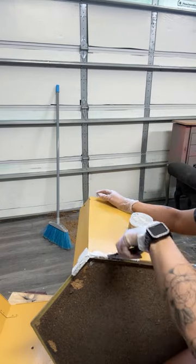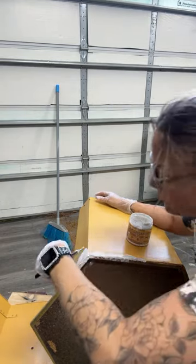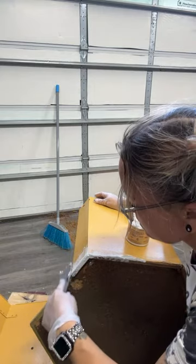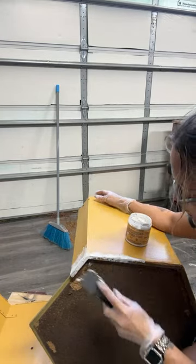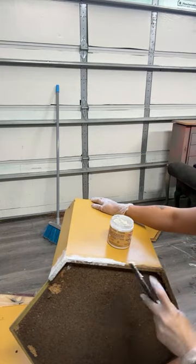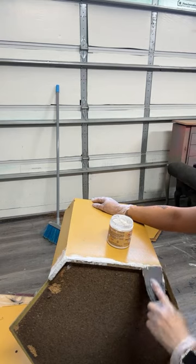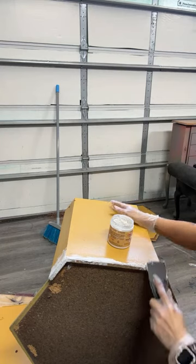All right. Yeah, Dixie Mud is amazing. I absolutely love it. It's my favorite. It's my go-to. In a pinch, it works great. Definitely don't need it up there. We're just getting the bottom. And apply a thicker coat just to kind of get that in there because you can sand back. It will shrink, so you may notice that you may need to do 2 or 3 applications of this depending on the area that you're doing. I'm trying to build up, so I may have to do more than one application. I'm just trying to get it in where we had ripped off with that razor.